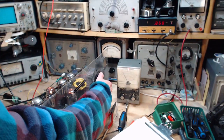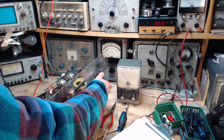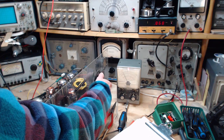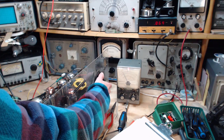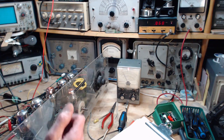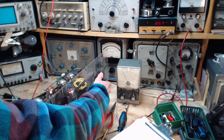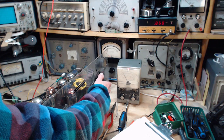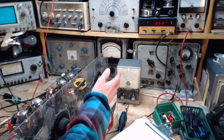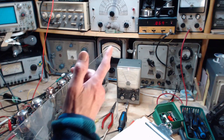So what I'm going to do is leave this at around, well, we'll leave it there. I'm going to tune the radio itself. Oops, a little bit of focus stuff happening there. So this is moving the local oscillator around. Anybody hear what I hear? So that tone that you can barely hear is coming out of the signal tracer. So there it is. The radio's receiving. Really?